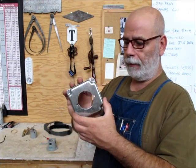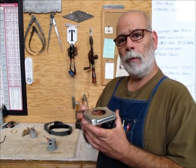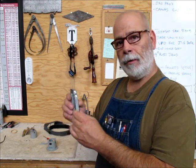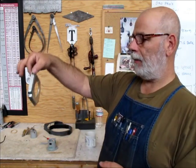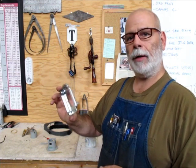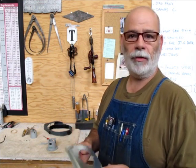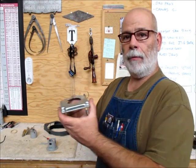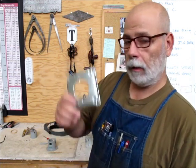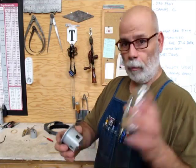I can do that in the lathe on a face plate, but getting it centered up — sometimes it's easier to put the part on a machine where you can move the machine to position it on zero, as opposed to positioning the part to zero. On the lathe, gravity is kind of working against you; things want to droop. Face plate work can be a little goofy that way. On the mill, gravity helps us and we can drive the machine around to get it on spindle centerline. So we're going to jump over to the mill, get some measurements, and open this little hole up.